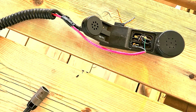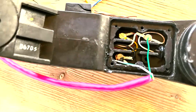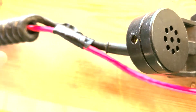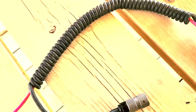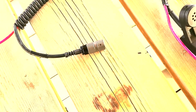Just a note about these builds: they are built so that you can still use the hand mic as intended, just with a speaker added. As you can see, the green wire is into the positive and the striped is into the negative, and then I taped up a little tension spot. I will cover this up with tape so that it is also protected, and then because it's going to be used on a Harris radio I was able to put it through the coiled section of the H250.